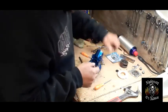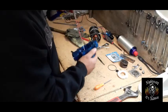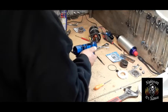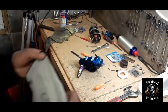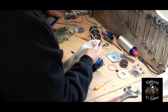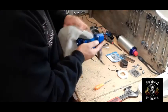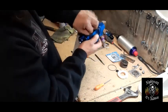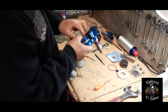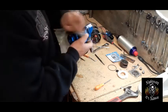We're going to spray some WD-40 on a rag and wipe the inside clean — get it nice and lubed. I've actually got another camera here catching the actual pump while this one catches me. We're going to wipe the inside of this and put this rag on the pick tool and run it in a circular motion on the inside where the seal goes — clean that out real nice. Make sure there's nothing inside there — be careful not to scar it.